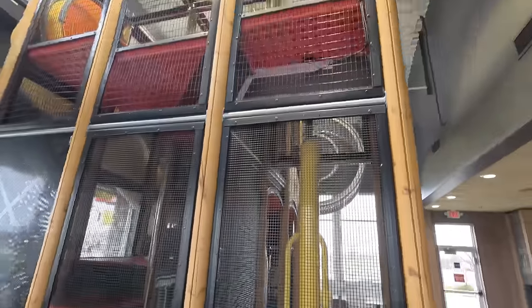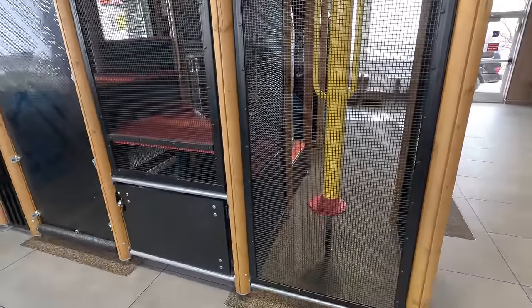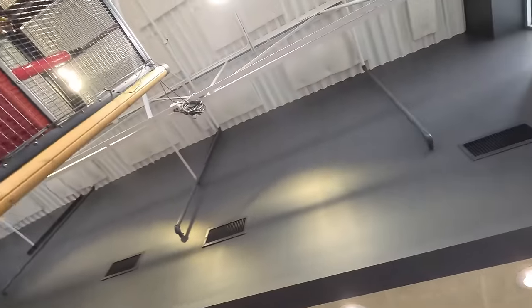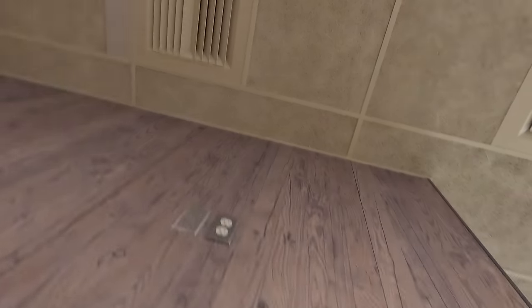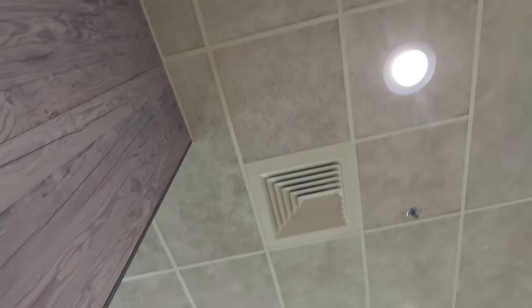All this area out here is nice and warm — it says 50-something but I can feel it pumping heat out and you can see the area we're taking care of. It's fairly high ceilings and this little area, the sensors are located over here on the wall, and we've got heat pumping out at these overhead register areas. So I just read through the task again. K1's too warm because the air conditioner is not keeping it up — it's not running real well at 20-25 degrees out. It was going into cooling. Either way it's pretty obvious — the air conditioner wasn't overcoming the kitchen heat, and the economizer looks like it's about done. The top section's not opening, the dampers are about shot, everything in the whole thing is about shot.